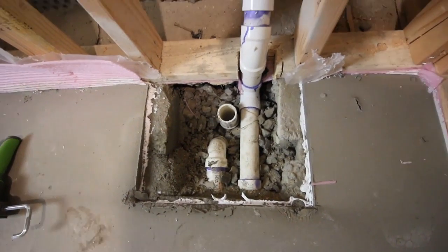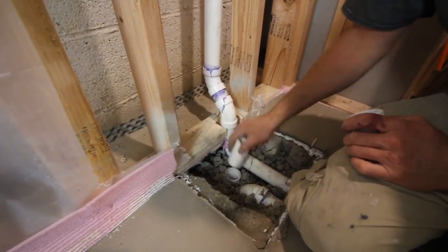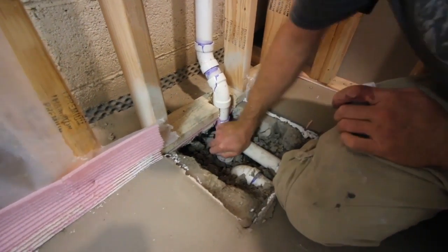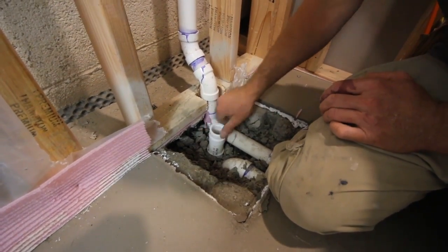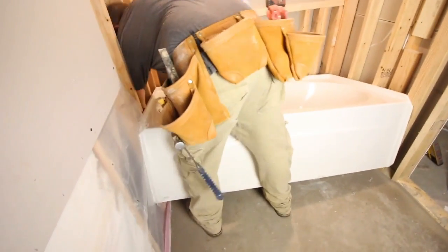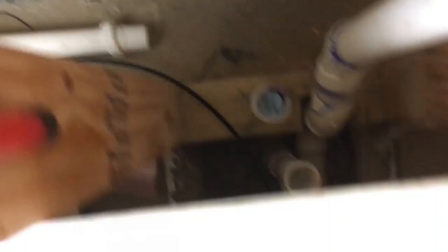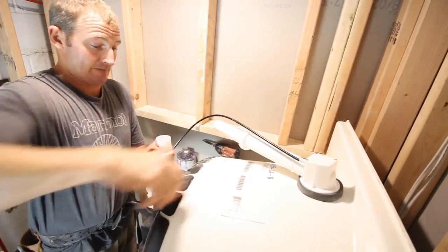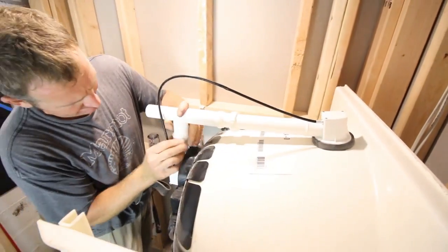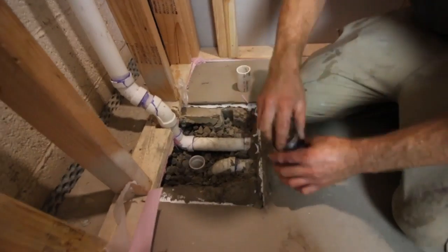This is an acrylic bathtub we installed in a basement bathroom. You always want to make sure it's vented. We're showing an adapter — sometimes you have to install an adapter in the P-trap so that your waste overflow pipes will fit. We're dry fitting everything, and we had to dry fit the bathtub to make sure the vertical waste overflow fit into the P-trap. It was off by several inches, so we had to adjust the waste overflow pipes and cut down the horizontal run using a rigid PVC cutter, which is an awesome tool.